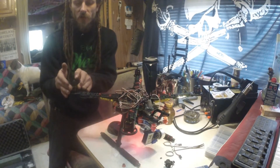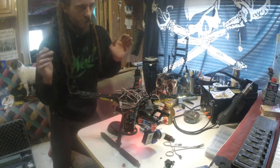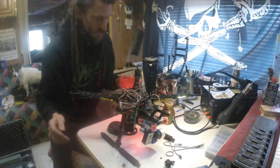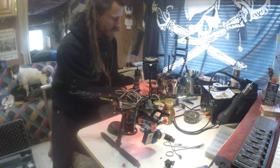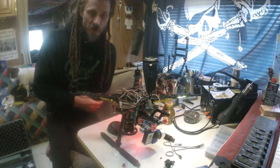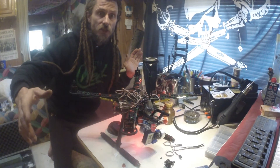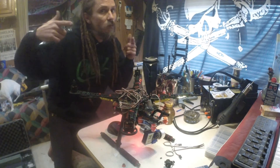The only reason I know this is a faulty motor is because I took it off another drone that I thought had a faulty speed control — turns out it was this motor. But now when I give it throttle, those ones spin counterclockwise and these ones spin clockwise. Motors are set up, we are good to go. Next step: put it all back together. Thanks for tuning in to Pirates in Teepees — please hit that like and subscribe button and have a piratical day!